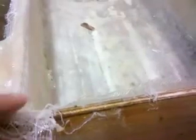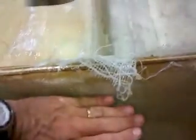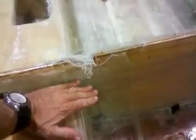This gets filled up with foam, so it's got a ways to go. And of course, all of this top edge here will be ground off, because once the floor goes in like that, the floor will come up like that, then I'll sand all the edges, and then another piece of cloth will lip and tie the 2 floors together all the way across the whole thing. So my next step is actually going to be cutting the plywood for that area right there, and cutting the plywood for that area right there. And of course that's going to cover up these holes, except for an access hatch, which will be right here like that.